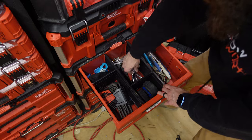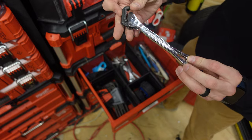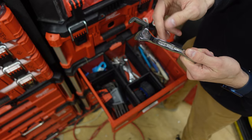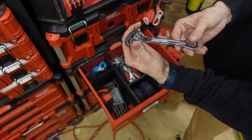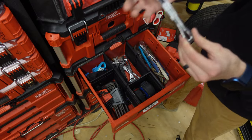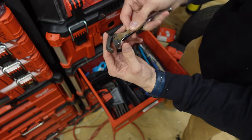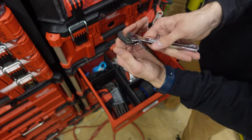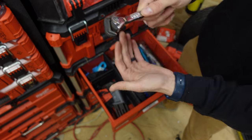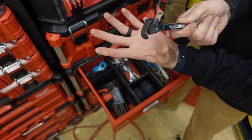This right here is the pipe vise — the miniature version. I'm actually waiting on a replacement because the spring is catching on this one, but I highly recommend this tool. It's pretty much like a ratcheting pipe wrench. If you're in a tight spot — whether you're a plumber or a mechanic — I highly recommend it. You can get up in the cabinet for an angle stop, tighten the supply line, and it'll just self-ratchet, keeping resetting itself so you can really tighten or break something loose. I'll put a link to this tool in the description as well.